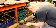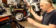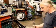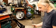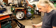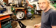But we've now got two tubes the same. So they've got to be cut back and prepared. Once I get it on the jig set up at the right angle, if I see that running up, I can just warm it with the oxy, and you can just flow it level. And there's a little bit of, like you say, jiggling once it's on the jig. Manual adjustment. Okay, so that's what's happening at the moment. We'll come back next week and we'll see if you've had a chance to get the frame on the jig and make some more progress.